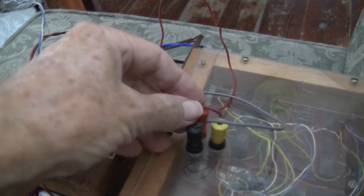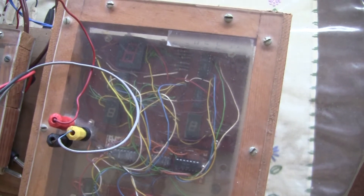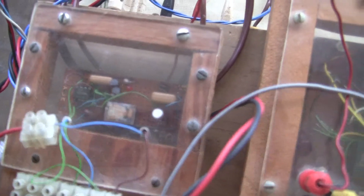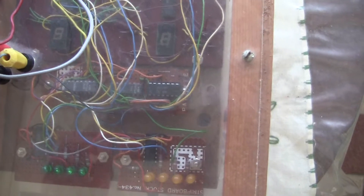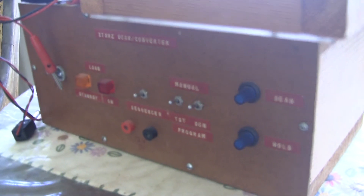Now what about shielding? Wood does not provide shielding for sensitive electronics, and you are going to have to use either some kind of metal or foil. These are low speed digital projects that did not require shielding. I tended to use a perspex front panel wherever there were LEDs that needed to be monitored. The perspex panel kept out the dust while allowing various LED displays — whether there were discrete LEDs or seven segment readouts — to be shown.